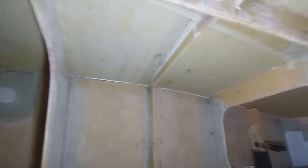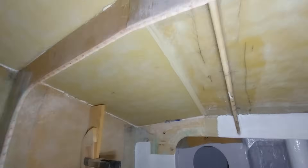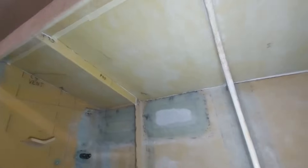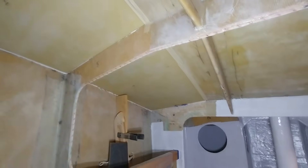I'm inside the cabin now — looks quite different with the deck on. What I'm doing right now is putting some masking tape along this seam you see here. That's just to keep any epoxy from dripping through, because I'm going to put some thickened epoxy on the other side to fiberglass that seam.